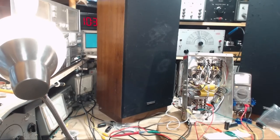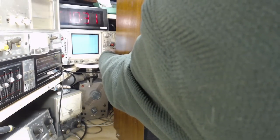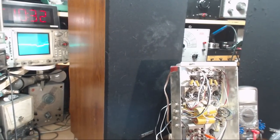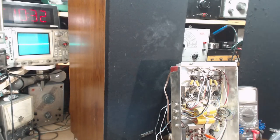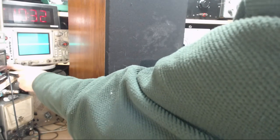Oh, so let's prove it with instruments. Let's prove that it's one channel humming with instruments. Okay, put this over here. So what I would want to try here is connecting up to almost anywhere. Hey, why don't we just run along the screens here and just see what we see. So I'm going to put this on the ground. Okay, right here. Now I do have this on full power. 28 millivolts, go down. We're on the AC.